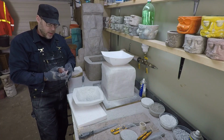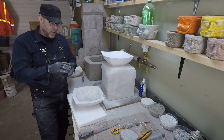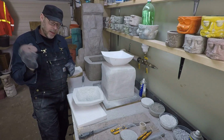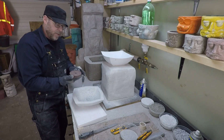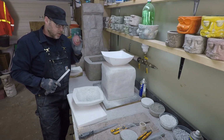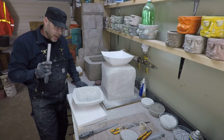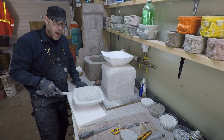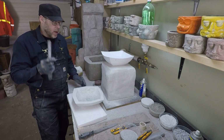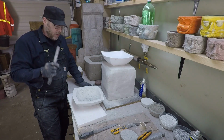This has different grits on it. Even you could use something like this. But this is a polisher, and this diamond pad here would fill up with this stuff that I'm scraping off very readily, and I think it would just jam up and be largely ineffective, where a diamond cup, like if I had to do 100 of these, I'm not using a rasp for sure. I have 1 to do, and I'm using a rasp, but maybe you have 100 to do.